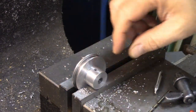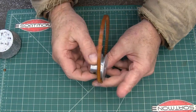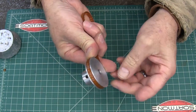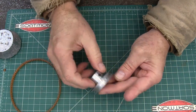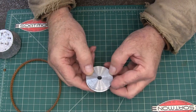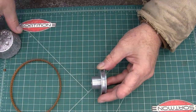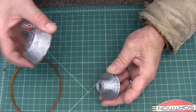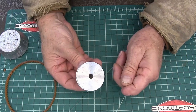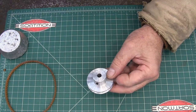I'm going to do another one at roughly 90 degrees to that one. Okay, that's got it done. As you can see there, it fits this belt — it's going to do a good job. If there's a little porosity in this aluminum, I was just pouring up ingots and wasn't really planning on using it to make anything, but I needed this pulley, so I turned a muffin into a pulley that's going to do the job perfectly. Well, I hope this was interesting to you. Thank you for watching.